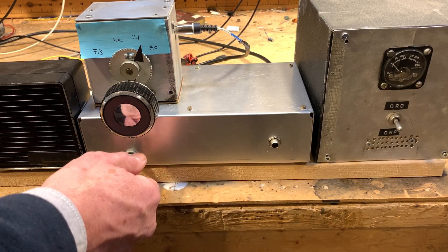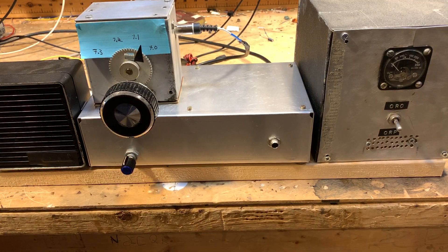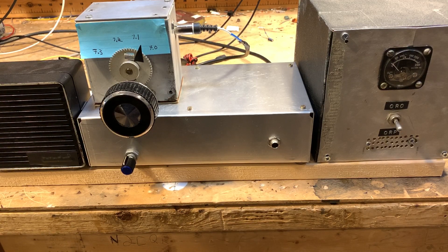Pretty good, huh? Anyway, that's the idea. There are a bunch of things I still have to do with this. I think the mic amplifier needs some shielding because it gets a little bit of feedback. And I've got to hook up a better bandpass filter on the output of the amplifier, because right now I think it's set up for 20 meters — I obviously need to put it on 40, but that should be pretty easy to do. Then this should be like a 35 or 40 watt, 40-meter SSB and possibly CW station. It's been fun to just kind of mess around with it a little bit, keep me busy while I'm in the final days of lockdown.